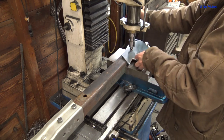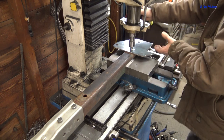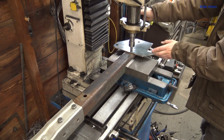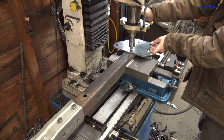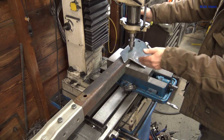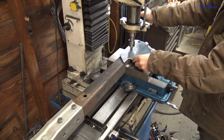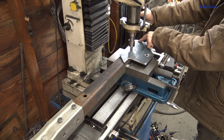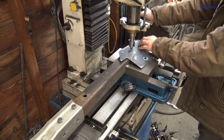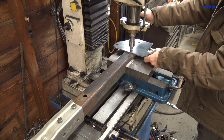So, this will be the frame of the wood chipper going off this way. So this will be the down position. And then the hitch will flip up, which is essentially the wood chipper moving. So this way will be the frame, so the hitch is now in the upright position. There will be a pin here that will transfer. I'll pull that pin out, lift up the hitch, put the pin back in. So that is how that's going to work.